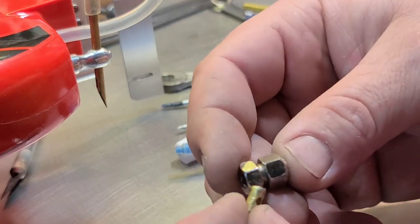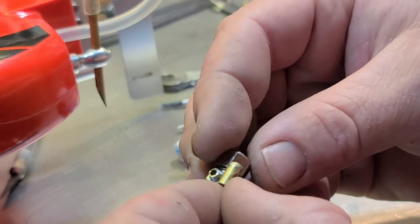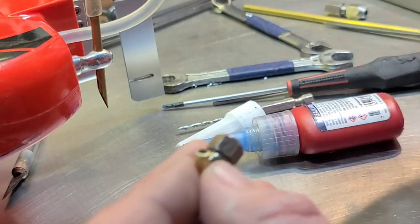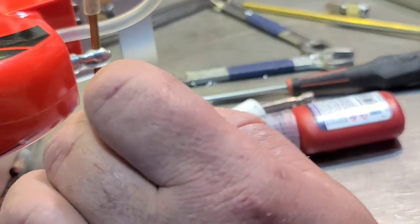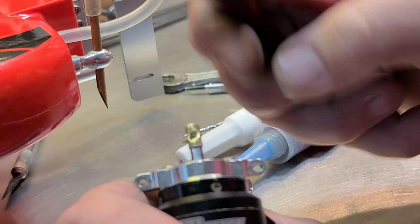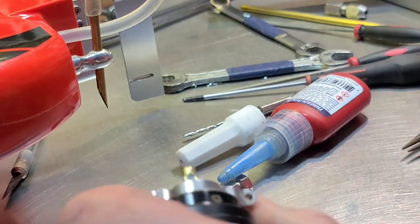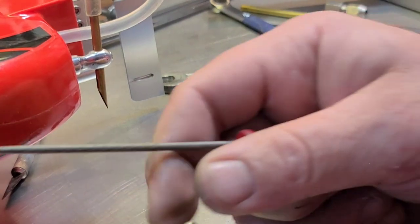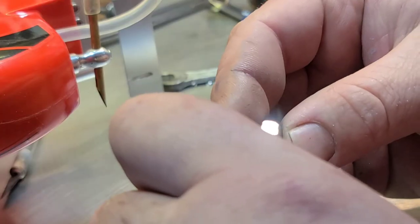With a really short collet, that shim will actually take up valuable space for our flex cable to sit in, so I'm going to take a little bit off the end of it. I got mine where she fits snug. You just want to make sure that the set screw is going to go where that hole is — make sure the set screw goes in that hole area.